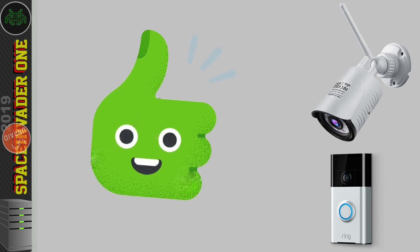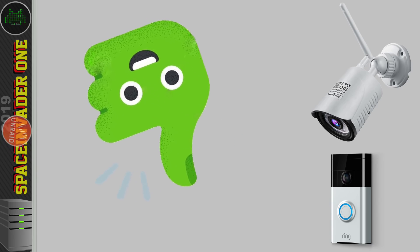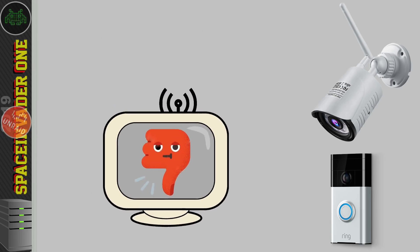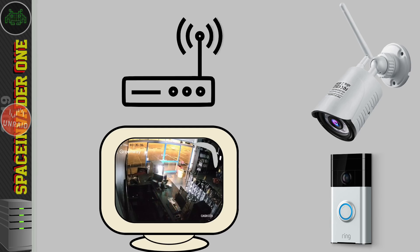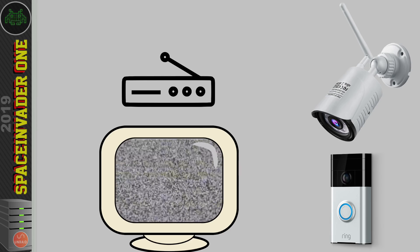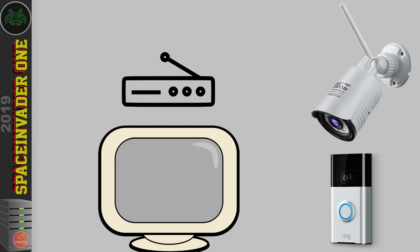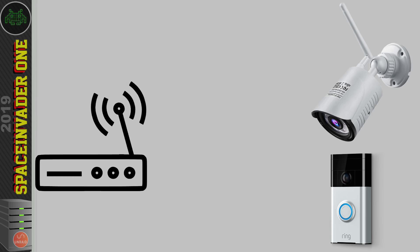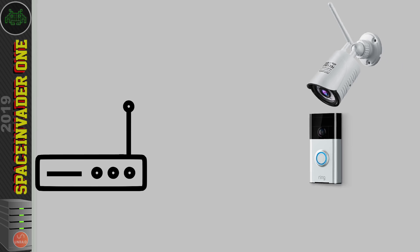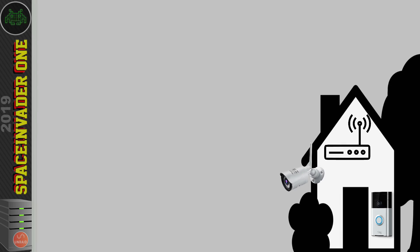But I'm going to tell you something the sellers of these cameras won't tell you — the reasons why you should never use a Wi-Fi CCTV camera. The obvious reason is if your Wi-Fi network goes down, so do your CCTV cameras. This includes any situation that stops the camera talking to the wireless access point, whether it's a weak signal or a faulty access point. And it's actually really easy to make a Wi-Fi camera disconnect from its access point and stop functioning.